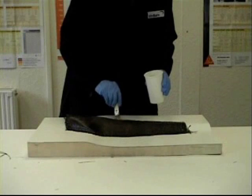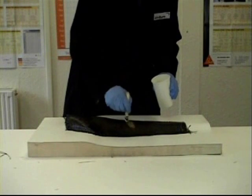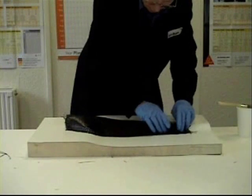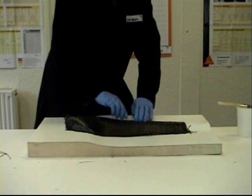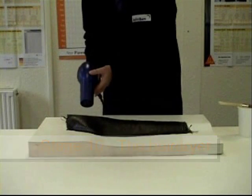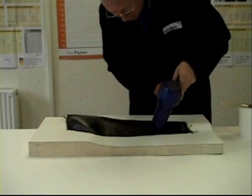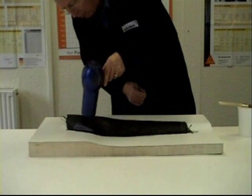Take your time on this last piece to ensure everything is in place properly. Have a check and see if you've brought all the laminating material through to the back. Any dry spots — just apply a little extra resin where you need to, not too much. You've got about two to three hours before the laminating resin starts to go off, so take your time, ensure the edges are down, the corners, and any tricky spots on your mould. Use your fingers to rub those areas in, but don't overdo it. A good tip now is to use the hair dryer just to warm up the part a little — this will encourage any little air bubbles or air voids to work their way to the back of the mould, preventing any air voids on the surface. When you've finished with the hair dryer, leave the part somewhere nice and warm to cure overnight.